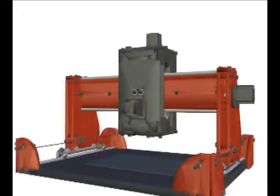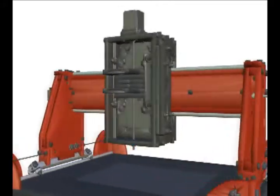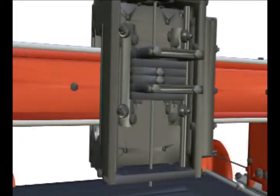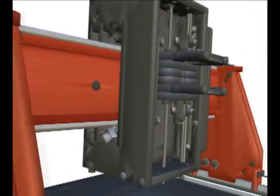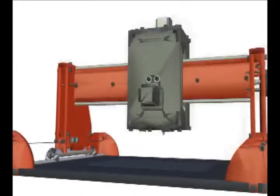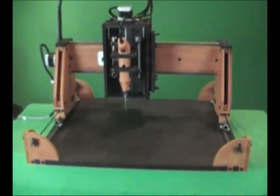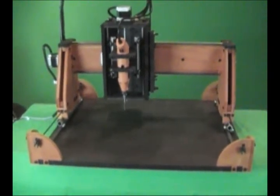One of the really cool things about this little machine is that you can make it bigger to give you a larger cutting area at a very low cost. It is simply a matter of going to your local Home Depot or other hardware store and buying a sheet of MDF and longer steel rails, then going to McMaster-Carr online to buy some longer belt — and you have a machine with an 8-foot or longer cutting area in an afternoon.